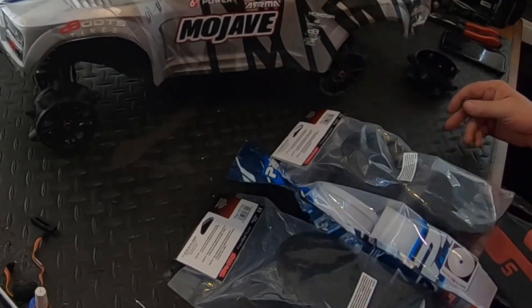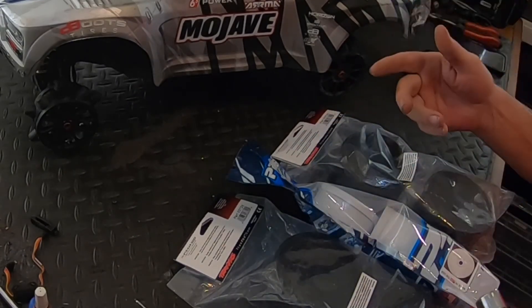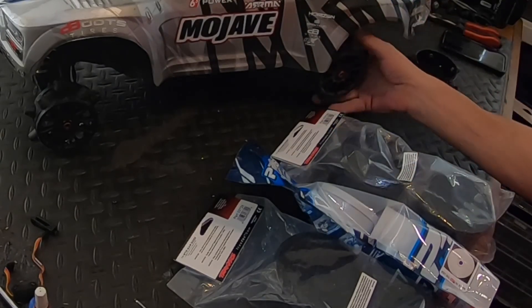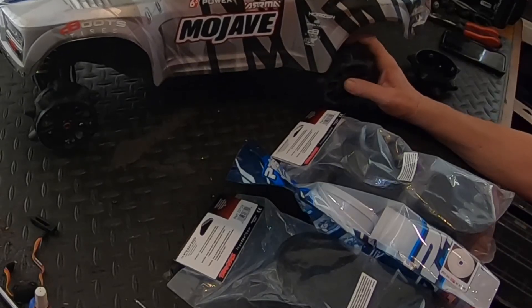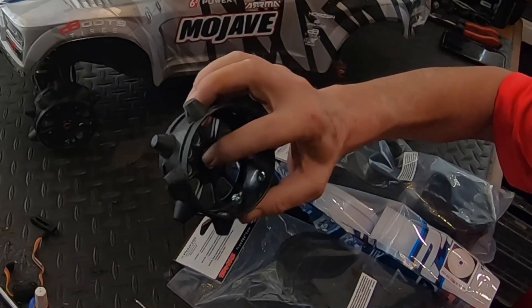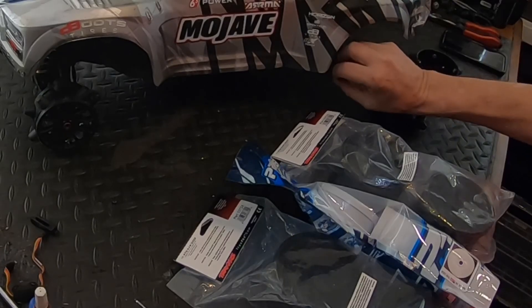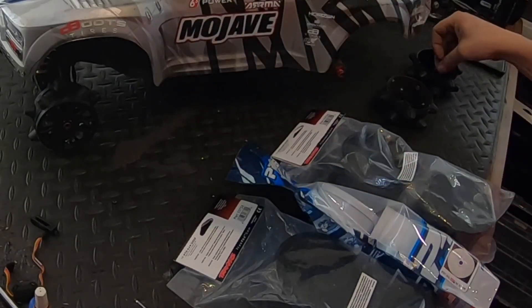I did let them cool down normally — room temp. I didn't stick them in the refrigerator to cool them down because then it would change the molecular structure of the plastic; it's kind of like forging with plastic. I'm hoping that the brass washer is still in here. I don't mind losing the hex, but losing these brass washers — they're hard to come by.